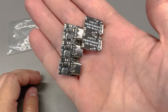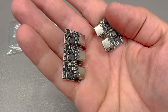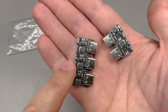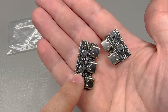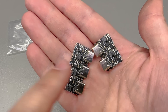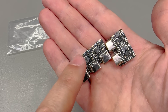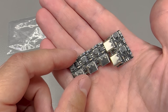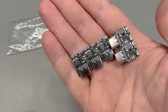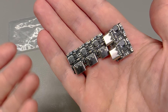In the previous video I showed some of these newer USB Type-C based single cell lithium battery charger modules, and they were pretty nice so I just decided to get more of them. The model I settled on is the switching type with multiple functions in one — it can charge the battery at 4.2V but can also provide a 5V output. If you're wondering if you can use this as a UPS for a small device, you can, but with a big caveat: it takes some time when the power is lost from USB before it switches the internal DC-to-DC boost converter, so you either need to add some capacitance to store the energy or just live with the fact that your device will probably reset before the 5V rail kicks in again.